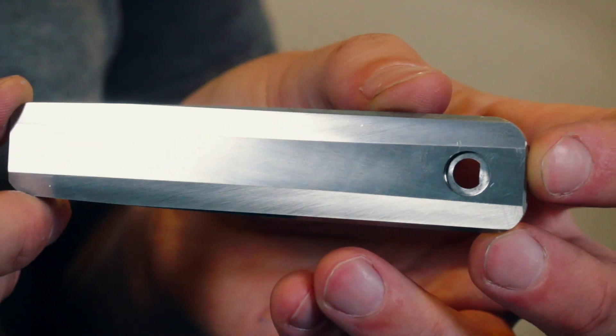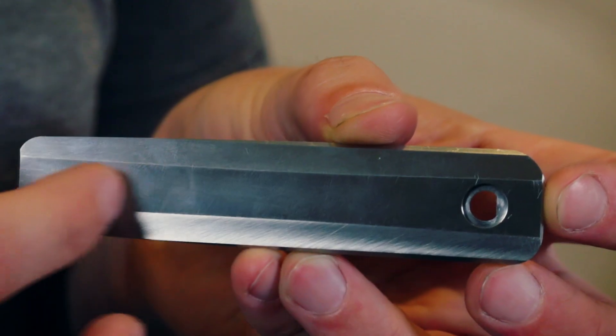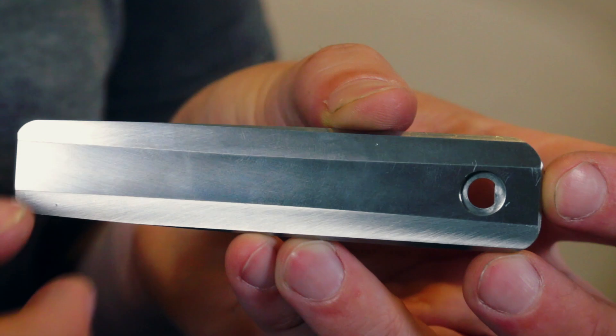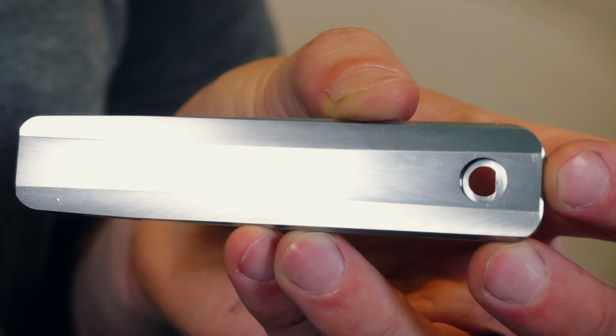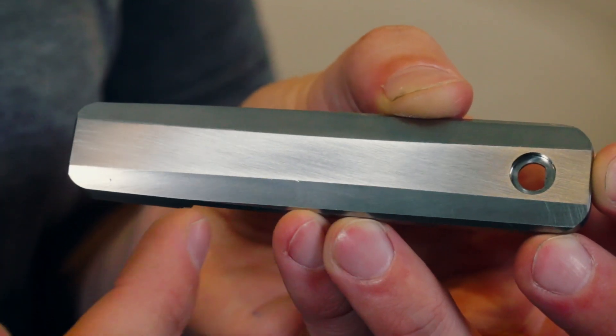The next issue: even though these machining lines are kind of nice, I don't really want that in here. It's a relatively high-end knife, so you want to get rid of that — some sort of pattern or finish inside that pocket instead. Another issue: if you look here, there's a flat spot all the way up. With the light just right, you can see it's like a dog bone — a little bit fatter up here, narrower in the middle, then fatter again. That one will be tricky because the scale is bowing during machining, and as you sand it flat you hit the ends before the middle.